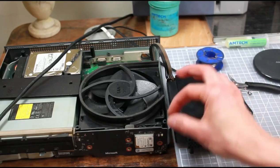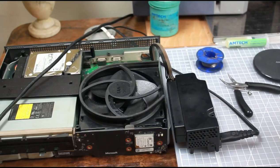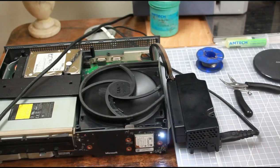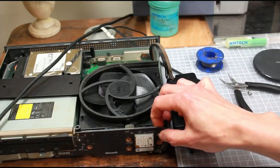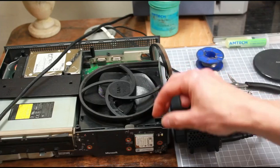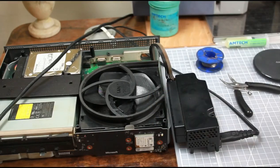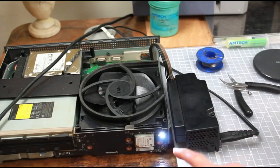I just wanted to show you what happens when you push the power button. It beeps and then flashes on and then suddenly it's just gone off again. There's a little bit of fan spin so it is getting some power. I'm not sure if you can hear but there's this kind of fizzle sound. Now it won't even power on at all. There it is - that little fizzle sound. So we've got power again but it's like intermittent power, and then it just shuts down.